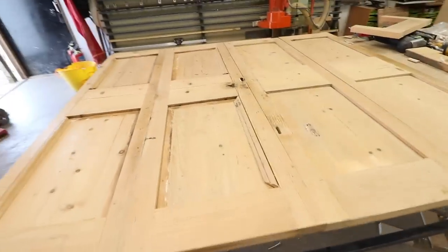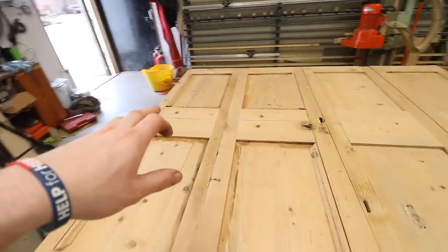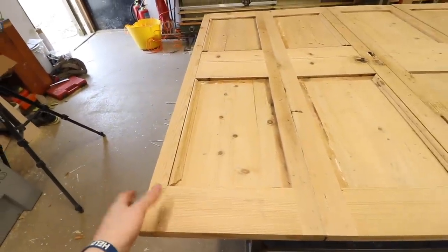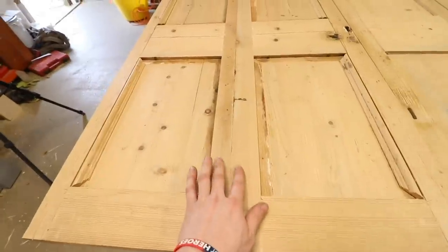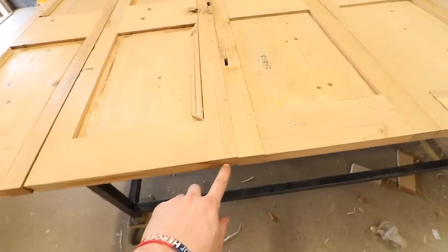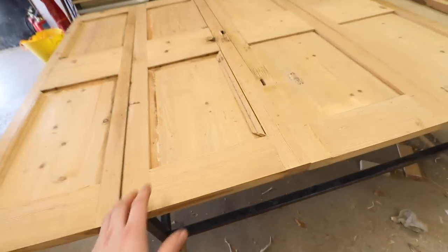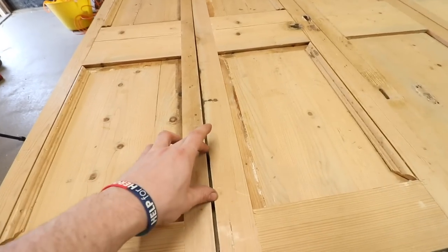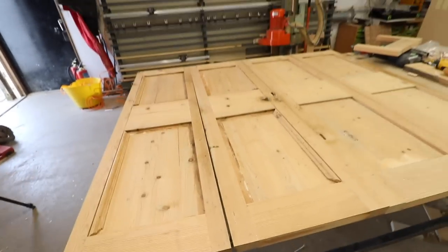Right, so next stages are going to involve chopping some hinges in. So I'm going to let the hinges in on the doors, like the first one. So the narrower shutter, I'm going to put the first hinge in to hinge it onto the frame. They then want hinging together as a pair of shutters, and that little keep that slides within the brass track needs letting into the end of the door. So that can all be done. I'll just do everything with a single screw in the hinges, because I may have to make any adjustments and I've still got a couple of holes to make that adjustment within the hinge.